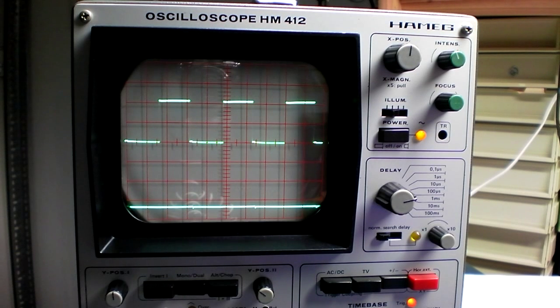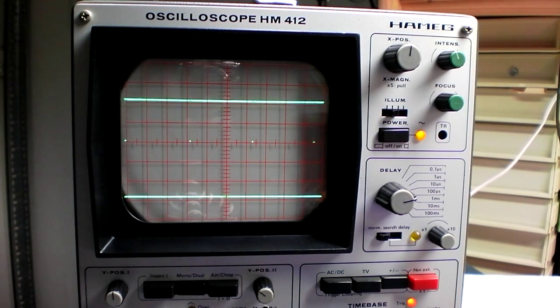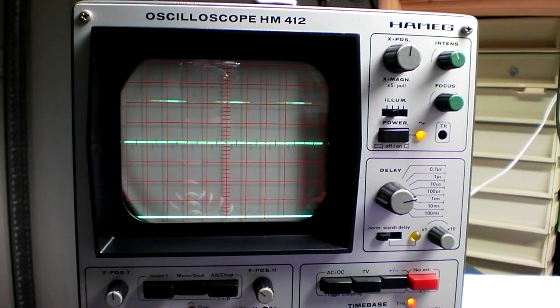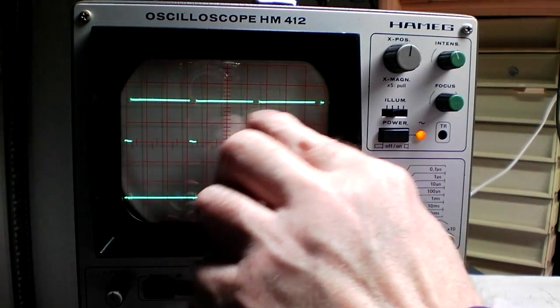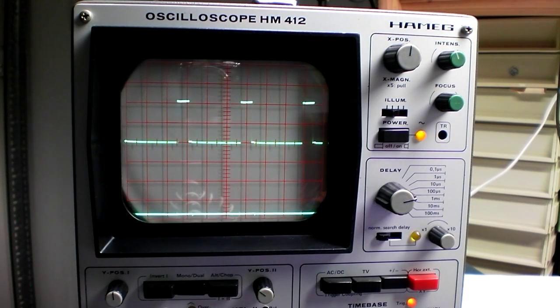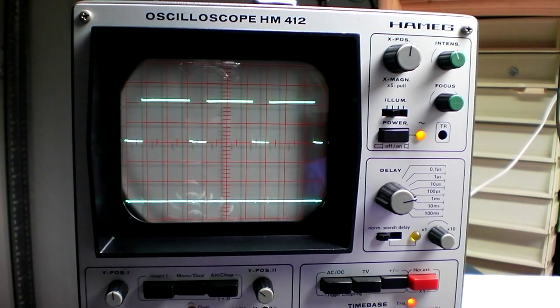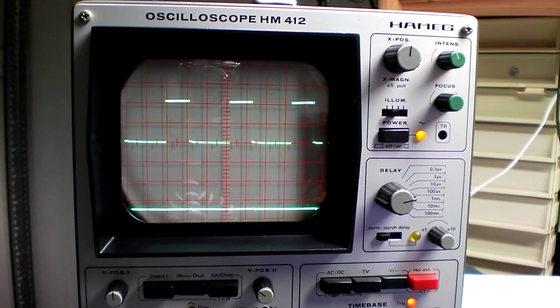So if I go into program mode, I'll hold it for 4 seconds. There we go, it turns off. And then it goes into the ramp where it enables us to select our fan speed. So as you can see, that's the voltage going up and down, and that's the pulse width varying. If I just press the switch again, that'll program a level for me about there.